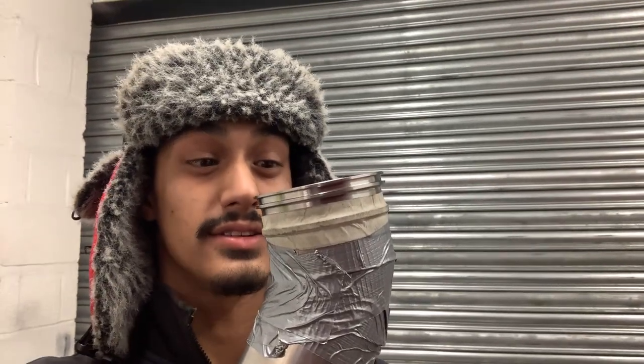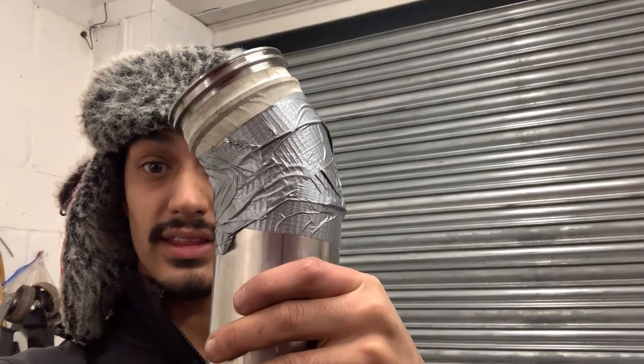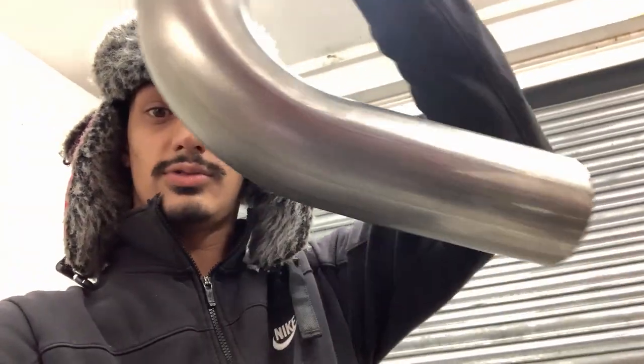It's been a few hours now and I've been hard at work. This is the pipe so far - it's got a vibrant clamp that goes on with stainless steel ferrules that Vass ordered, which is why we were waiting about two weeks. The pipe has a pie cut section which I literally just figured out how to do - we googled and YouTubed it to figure out how to cut pie cut angles. Then that goes into a 90 and this is going to go from the throttle body, come across the body of the car and hopefully end up in the intercooler.